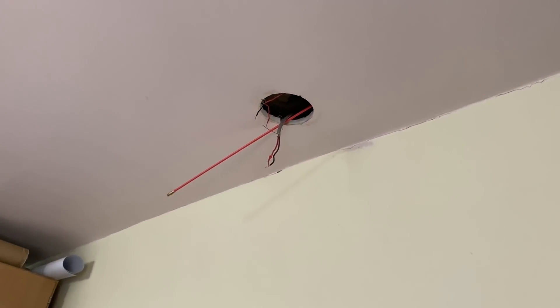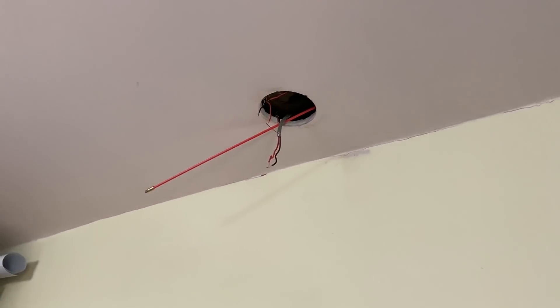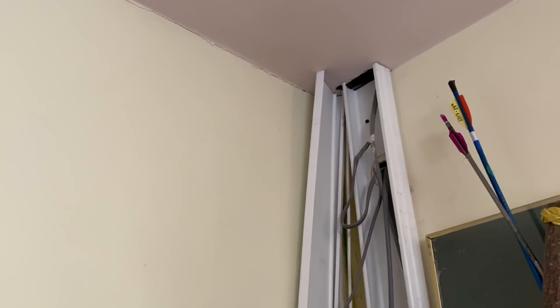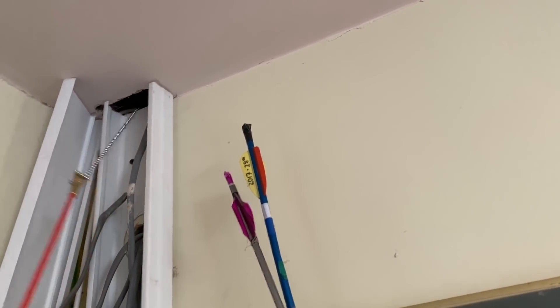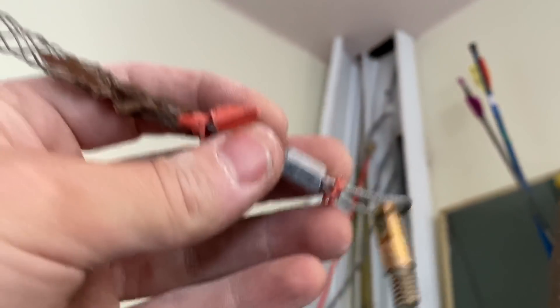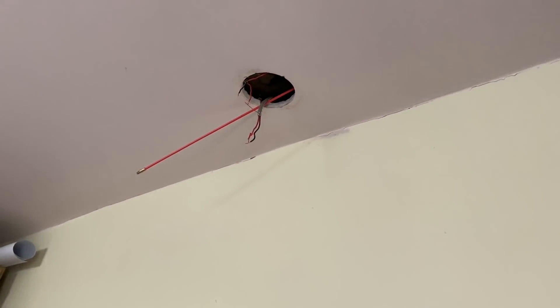For new subscribers, the Super Rod Mega Set is what I use for my rodding needs - it's absolutely brilliant. I've put two lengths of red rod in - the red ones are slightly stiffer - with a bead chain on the end and a magnet. I poke the magnet in, fish the bead chain down, pull the end of the rod through, then attach the cable sleeve which screws onto the rod end to pull the cable back. It saves me so much time and energy fishing cables.